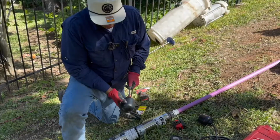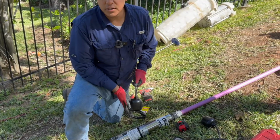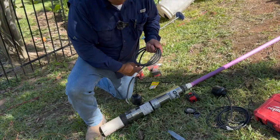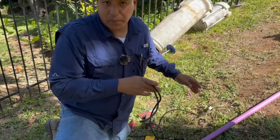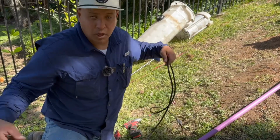These Aiders have a 4-inch mechanical float. Yep. So that means it's got to travel 4 inches for it to actually turn on. Okay. So if you're ever having to replace one on an existing system and you can't find the plans, I would usually just match it to where the other ones were.